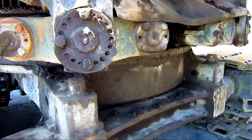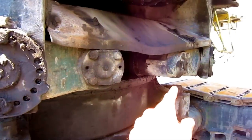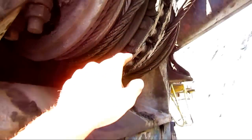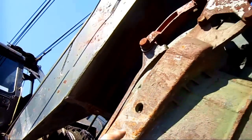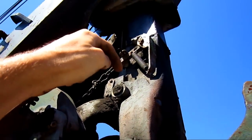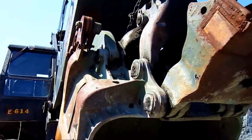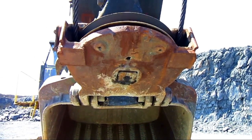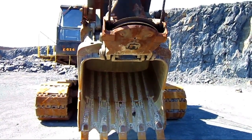The 88B was designed with hook roller swing bearings and an external swing rack. Right here, you can see two of the big rollers — they'll swing the shovel left or right when it's running. These two ropes right here control the dipper handle; they run up inside the boom to the pivot point and extend the dipper handle out or pull it back in. On the top of the bucket in the front, you can see the single sheave with the rope running around it, which picks the bucket up and down to allow the machine to cut into a lift.